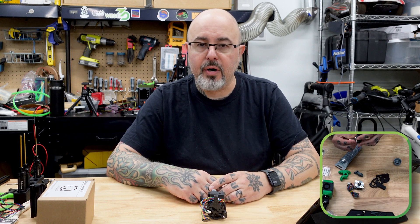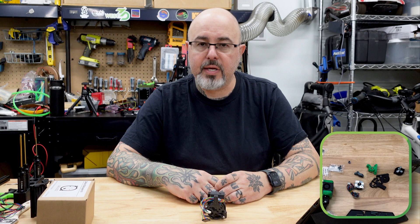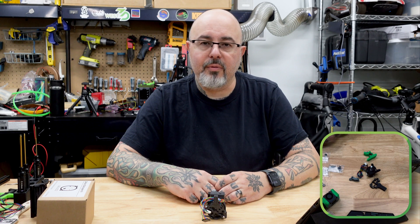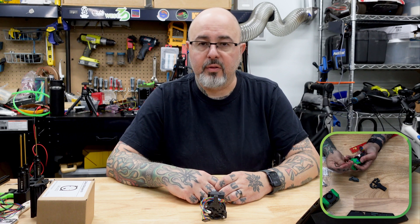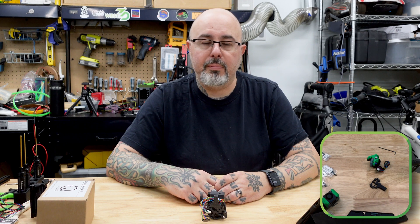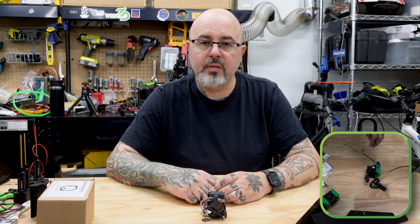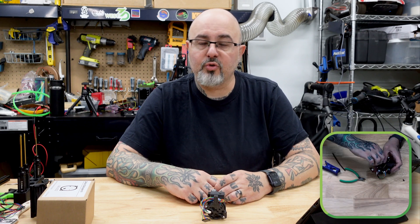Putting it together was pretty simple. There are only three main parts of the extruder itself. I also printed the canboard mount for the back using the newer three mounting point design. Had a couple of issues — nothing too big other than getting a little enthusiastic with the insertion of the ECAS Bowden tube holder and cracking the front, having to reprint it. Once I got through that, everything went together pretty easily. Just had to align the drive gear with the hole in the front, then put all of it in and put the canboard mount on the back and transfer everything over.